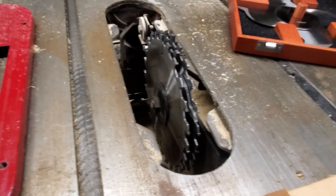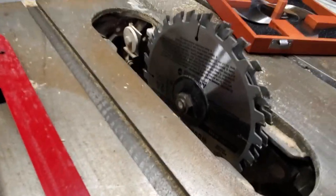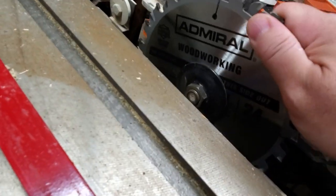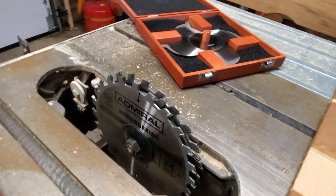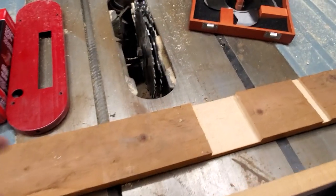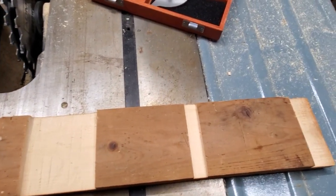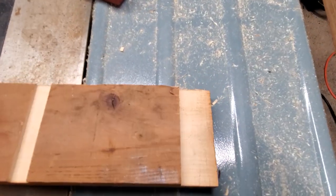Pardon the shake while I do so. All right, so here you go. This is the setup — I just have it with three chipper blades set up right now. Crank around here so you can see the Admiral 25 carbide teeth. It seems to get really good reviews online, and here's the results. This is just kind of a junk piece of scrap wood that I've tested, and it's a real nice clean cut. I think that'll do the trick. I just did a few different test depths and kind of cut the end off for a joint there.